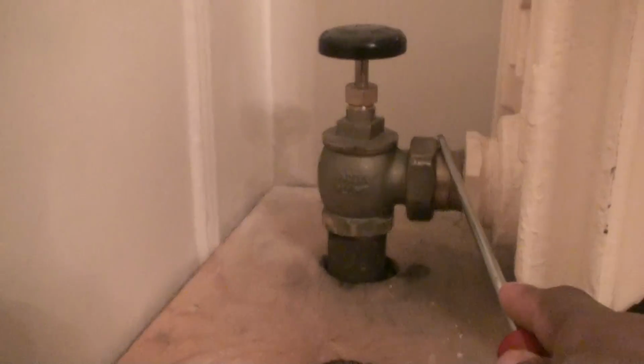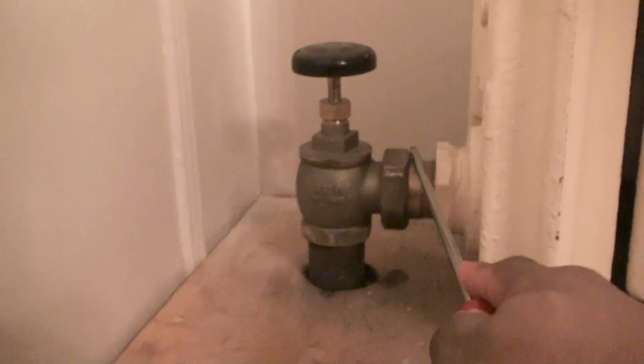The 2 most effective ways is have your inlet on the bottom and then your outlet on the bottom, end to end, the lowest point to the lowest point. The reason why I say this is because steam is going to naturally rise. So as you're sending it up through the bottom, it's going to make its way to the top.